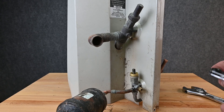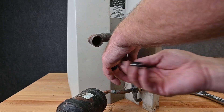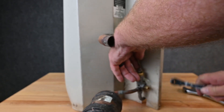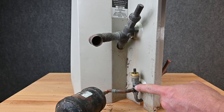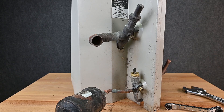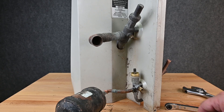With these valves, what you have to remember to do is back your service wrench up and backseat it — back this valve all the way up. With the valve backseated, these two ports are open and this port is closed off, so you can take your gauges on or off safely. I like these valves because they allow faster flow of refrigerant — there's no Schrader port slowing us down.